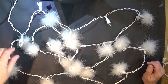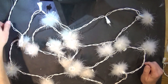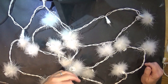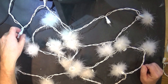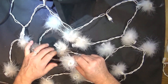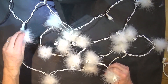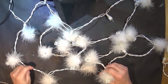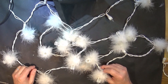We have them all laid out in a line, so we can count them. They're all in series and we've got 240 volts coming in, so the voltage across each is 240 divided by the number we've got. Counting: 1, 2, 3... 20. So 240 divided by 20 is 12 — we know they are 12 volts.